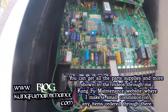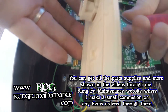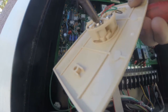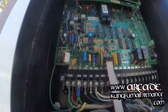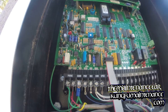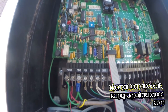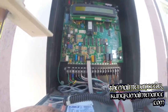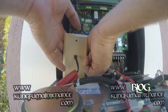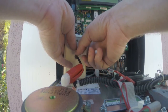I need to make a quick rig in order to test this. I have this type of tester. What I'm going to do is take a telephone jack, plug it in here, and I'll just connect the red and the green wire. Now I can use these to test with. I'll use the red and green wire to see if I have a tone — and I do not have a dial tone. So I'm going to test this elsewhere and trace it out.